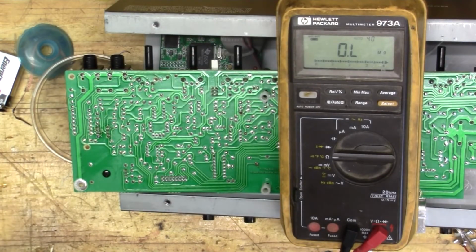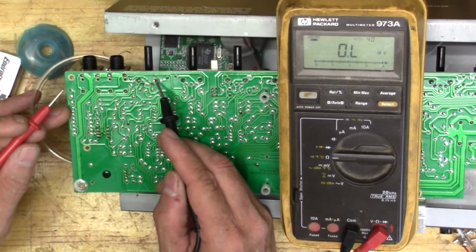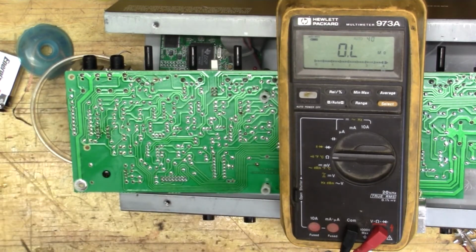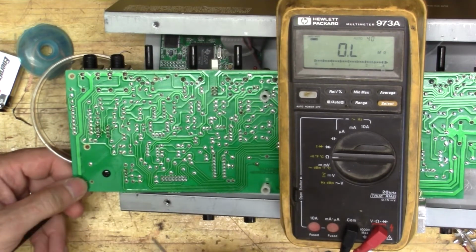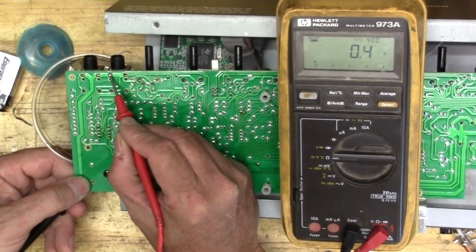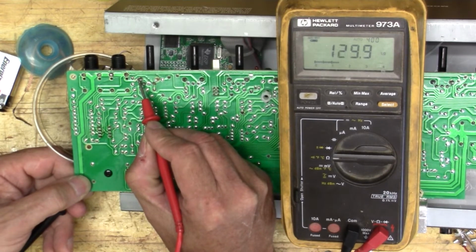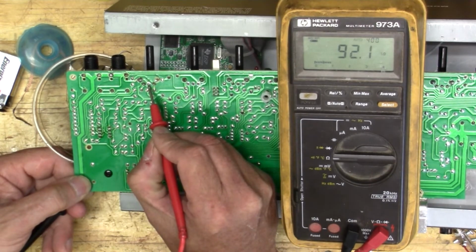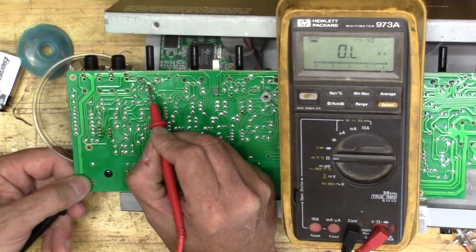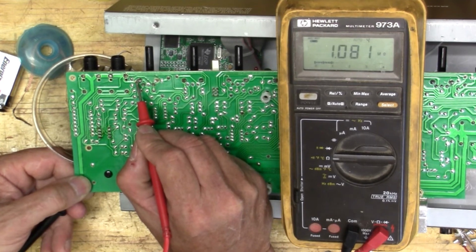It seemed fine, and so then I put it back in, and I noticed that these traces were very loose where the potentiometer went in. And so if I check the resistance to ground, right here it's 0.3 ohms, which is good. But then when I come here, it's 48 kilo ohms, and then here it's bad too. And so this is the center of the potentiometer. That has to be grounded according to the schematic. And what's happened is right here the trace is cracked.